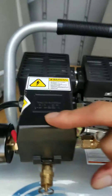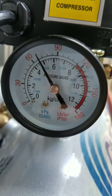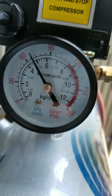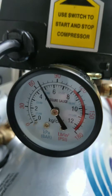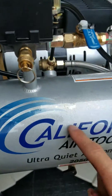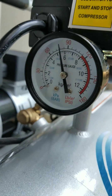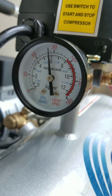I just opened this up and adjusted it so it will go up to 95 PSI and shut off, then start back up around 70 PSI. It's on right now filling up, and if I close this it just starts to fill this tank and not the big one, so you can see it starts going back up a lot quicker. You'll see it's going to shut off right after 90.